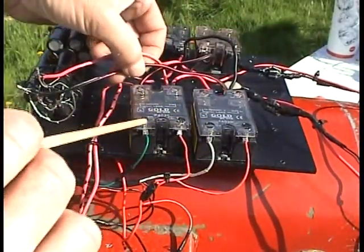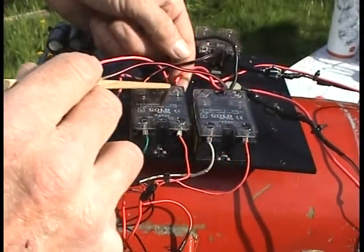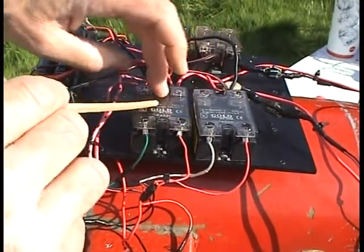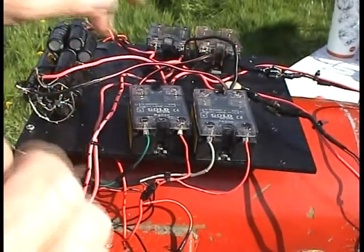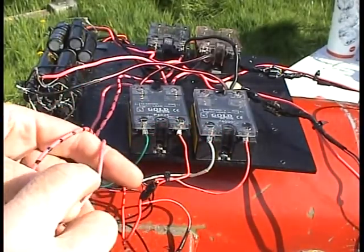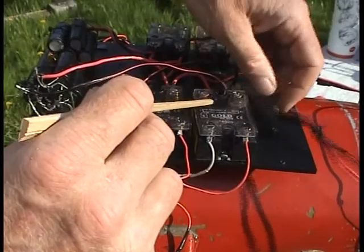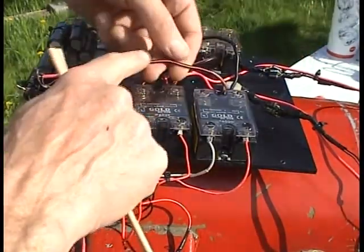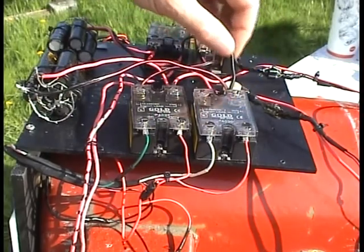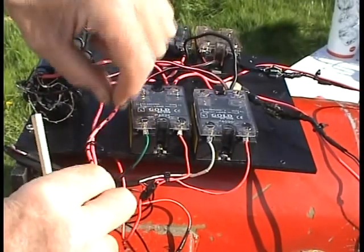Here's the discharge relay. The red wire from the coils is hooked right to it on the positive side, and when this switch is on it sends the power out to one side of the two AC wire outputs — this happens to be the silver one. To complete the circuit so it becomes a cap discharge, the ground of the cap goes over and connects to the other side, to the other AC wire.